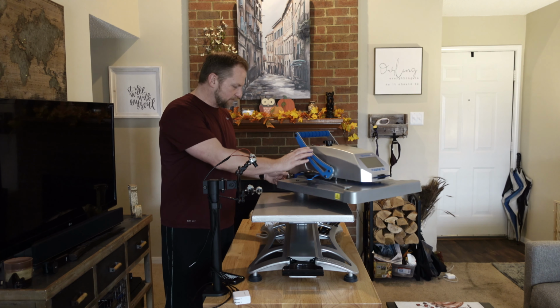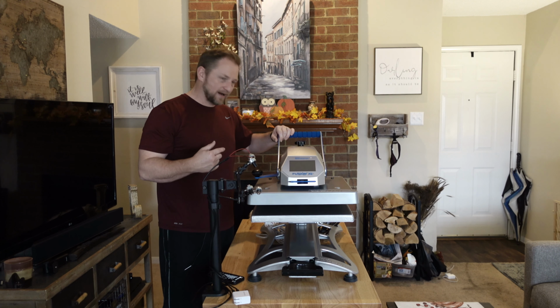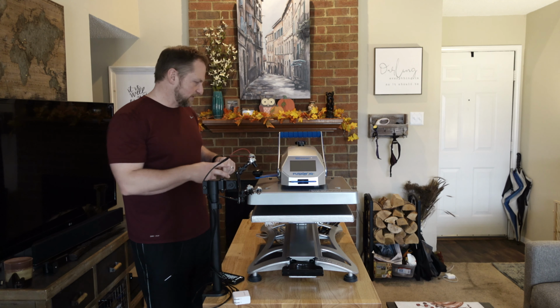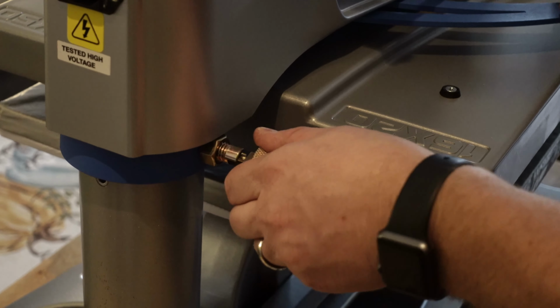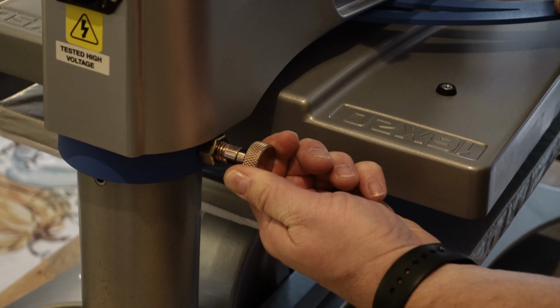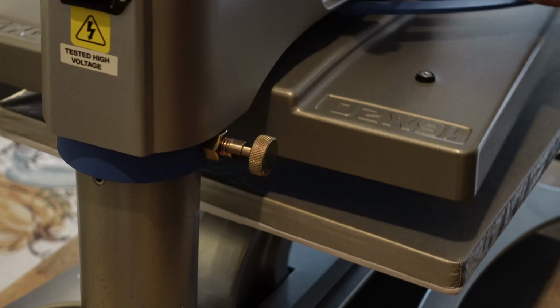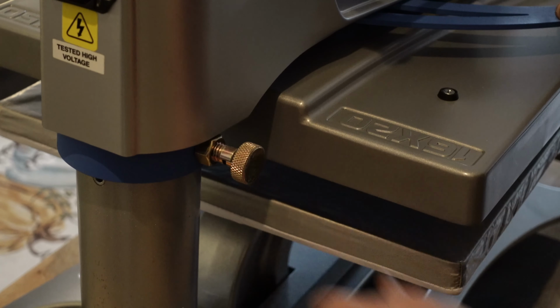And it has this little locking pin, so when you rotate it, you'll hear it in a minute. Okay, lock back into place. Now this isn't gonna budge. It took me a minute to actually figure out that you can lock it into place. You pull it all the way out and then rotate the knob, and that will allow it to keep going without locking back into place, because it can obviously be frustrating to have this lock every time you're trying to use it. So anyway, another advantage there is that you get the swingaway option.